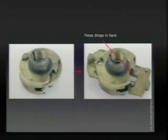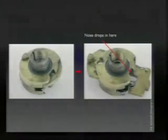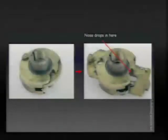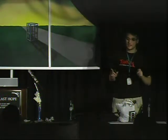So the trick is that the cam is a clever little mechanical spring-loaded device, which has this little spring-loaded slider. The idea being that the slider, because of the design of the lock casing, can only slide away from the gate area at one particular point on the dial. And when it does this, the dial is very firmly locked in place. As in, you can't move it even enough to reach the ends of the gate area. You can only move it enough to retract the bolt, which has been cleverly designed to retract in less area than it takes to reach the ends of the gate area.